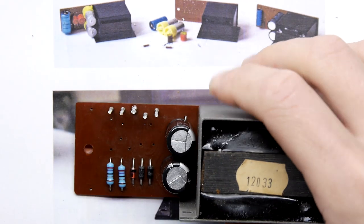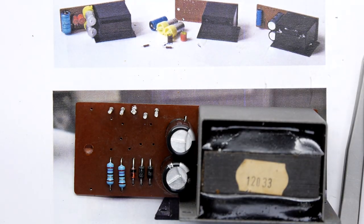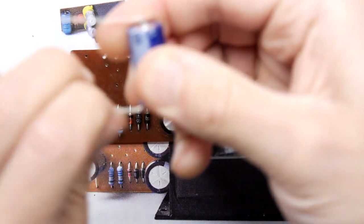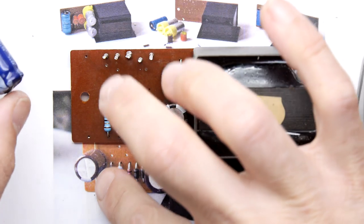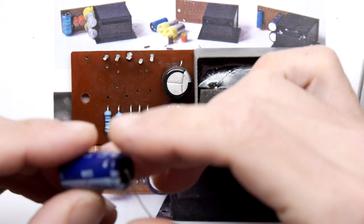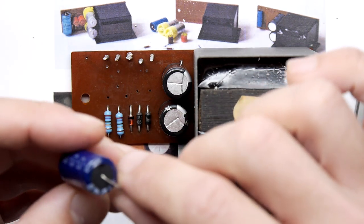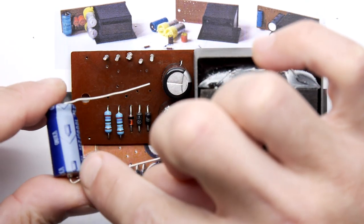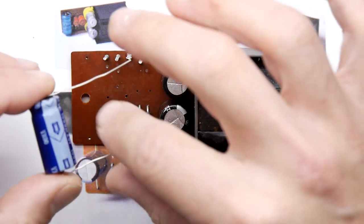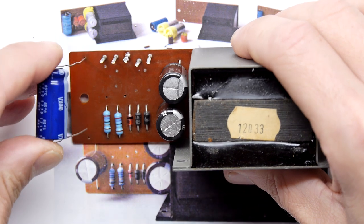One more component, and that's the power supply done. We made good time on that one. So it's not quite the same as in the picture, but that's absolutely fine. In fact, it's better. They've obviously replaced this with a better laid out component. Just make sure, you can see the picture there, you've got the negative on this pin. So there's your negative here. And it's saying this way, this one is negative. Look, negative this way. So we shall put it in that way.